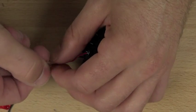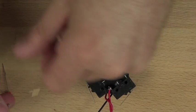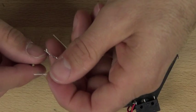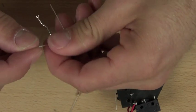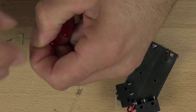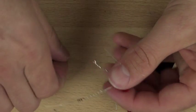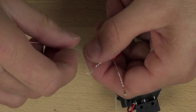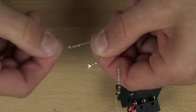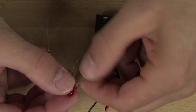This makes it easier to connect the positive side of our battery to our LEDs and other components. Now we're going to connect the resistors to the LEDs. The resistors prevent the LEDs from taking too much current and burning out. Put the resistor leg at about 90 degrees opposed to the LED leg and wind it around the LED leg at least four or five times to make sure we have a solid contact. That's the negative leg — resistors can go on either the negative or positive leg, but in this video we chose the negative legs, which are the outer ones. Twist it all the way around until it's firmly connected.